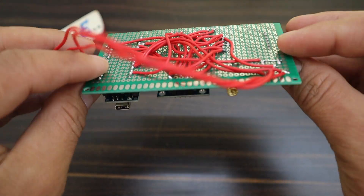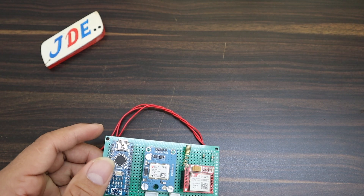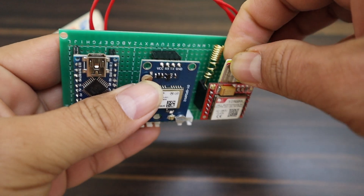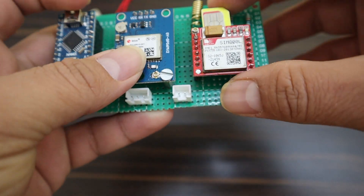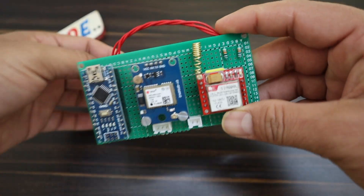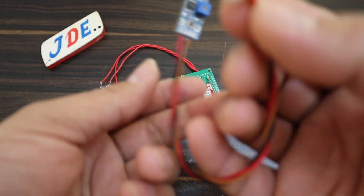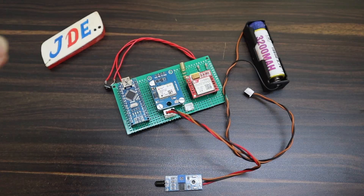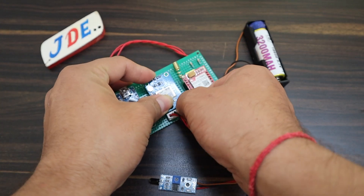Okay, let's see the hardware. This is a really compact size project and I provided all connections including Arduino Nano on a single zero PCB. Now I attach the SIM card — you can use any SIM card. This does not require 3G; a 4G SIM card also works. Note that in India, Jio is not supported. Now I attach the flame sensor and connect the 3.7V lithium-ion battery.